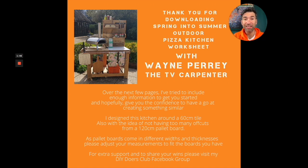Originally I was going to put a piece of marble on there — you can get a marble square for about 35 quid, but you've got to seal it because marble is porous. When I was in the tile shop, Tops Tiles, I asked if they had anything that looks like marble that can be used outside without needing to seal it, because once moisture gets in they crack. So you need to make sure it's porcelain or similar. He said yes, and the one you see in the picture looks just like Carrara marble and I think it costs 16 quid from Tops Tiles.